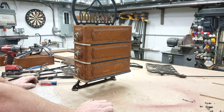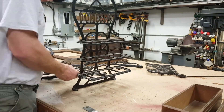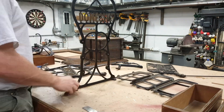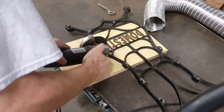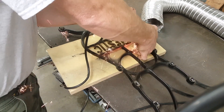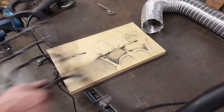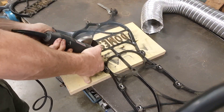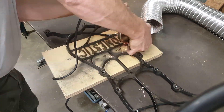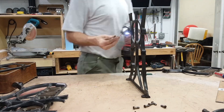I'm looking at where I have to cut that cast iron, and I decided to cut it just above the word 'Domestic' on the cast iron because I wanted to keep that logo for another project. This is just a rough cut using a cutoff wheel — it's pretty soft metal being cast iron, but I have to come back and find the actual precise cut.